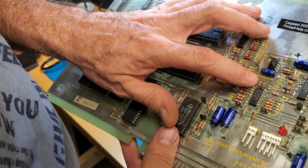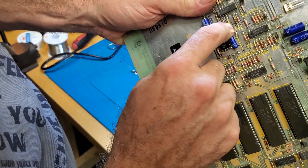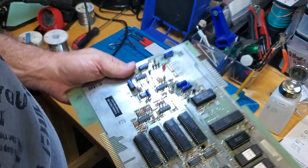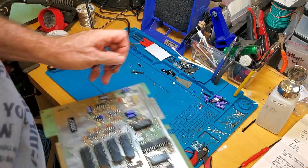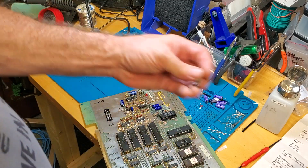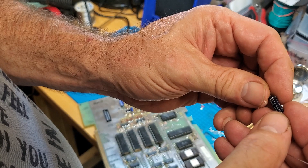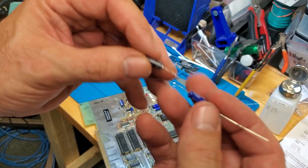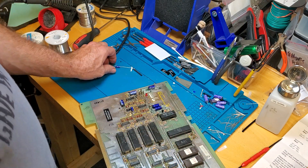I've got a picture I can refer back to, and I can also look on the board — you'll see the positive side marked, so these two are in the same orientation. There's a little plus right there at C52. I've got my capacitor here and always check to make sure — this was 10 microfarads at 50 volts. 10 microfarads, 50 volts — that's what this replacement is, 10 microfarads — so I'll put that in and re-solder.